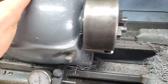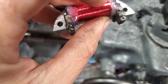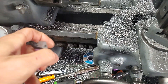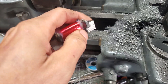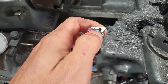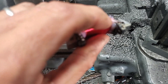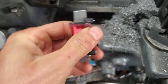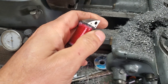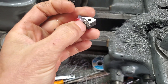Another thing to do when you have the bare coil — and I'll show you some pictures if I can find them — double this wire up about that long and twist it, and just do the first two wraps with that doubled wire, and solder that double wrap to this terminal. It just gives you a little more beef for that initial soldering. The wire has to run from this terminal down onto the body. Then when I'm done, I do the same at the end: I double the last wire wrap, twirl it together, wrap it around, strip the insulation off, and solder it over here — so both ends are at least doubled up.